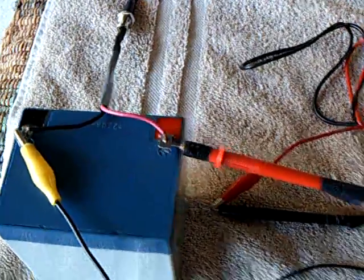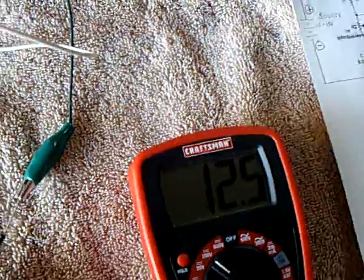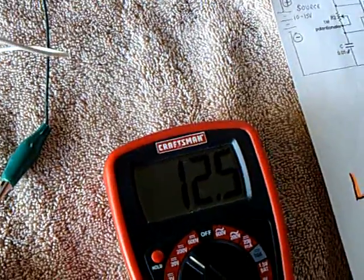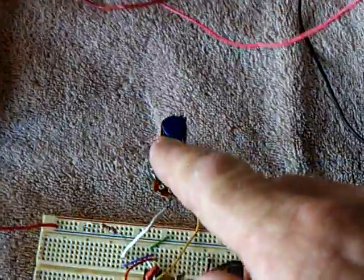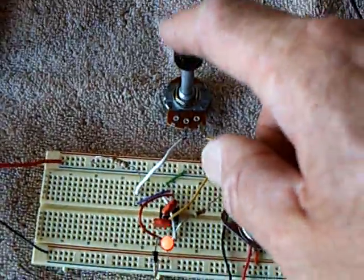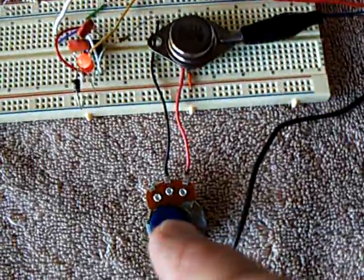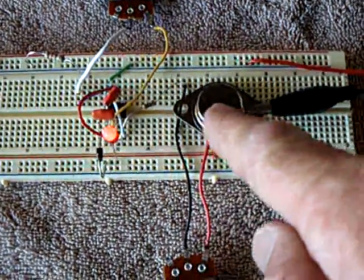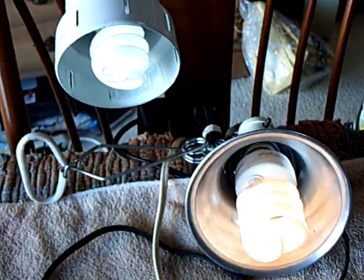That's what I found was the easiest way to do it. You can also use a charge battery, charge it up, and swap batteries. On this particular circuit it tops out. There's a potentiometer for controlling the 555 timer part of this, and I put a potentiometer in here to control the base resistance on the transistor. Between these two, you can get them synced and get these lights to work. I worked and worked on this until I figured out how to do it.